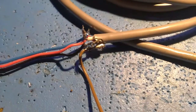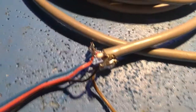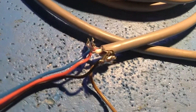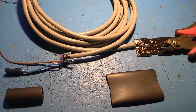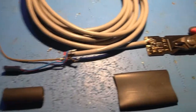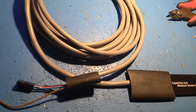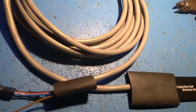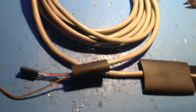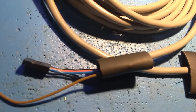All the wires are soldered up, along with the outer ground wire for the shield, which we're going to take to a ground pin. I'll go ahead and trim these up and fold them back. Now I'm ready to apply the adhesive-lined heat shrink — sliding that over, and here it is applied. Now we just need to heat it up. Make sure you fold the connectors backwards so they're not in contact with each other.